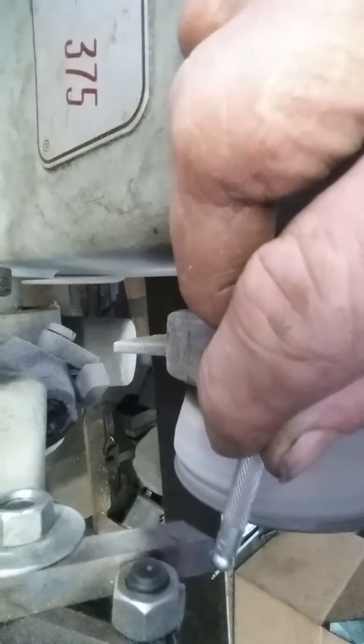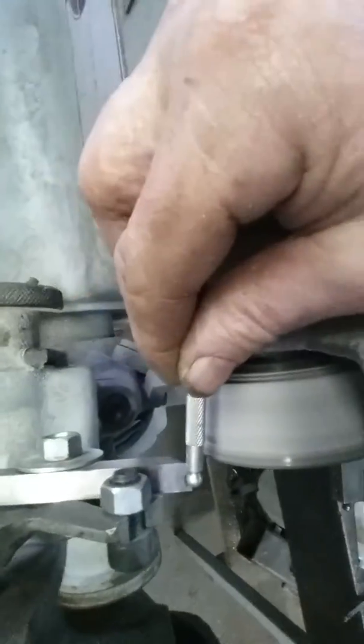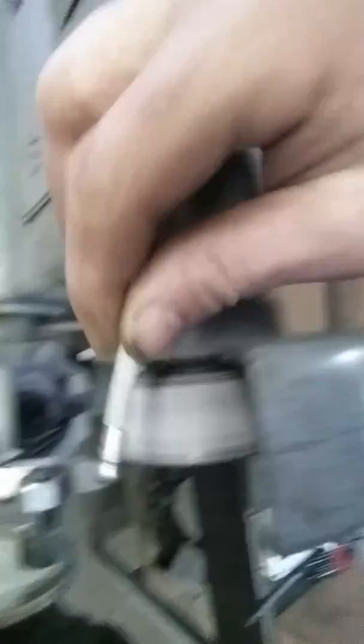You can see that's pretty close to the radius I need. My phone's a bit goofy, but that's pretty close to the radius. All I'm gonna do is touch up the ends of the tool and then I'll get it on the lathe and hopefully we'll be making parts for Brown & Sharpe really quick.